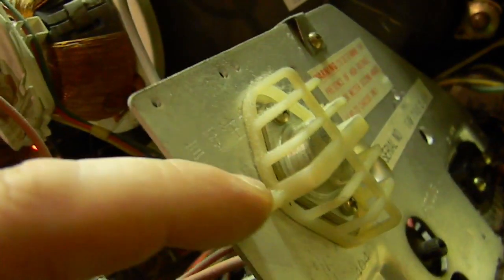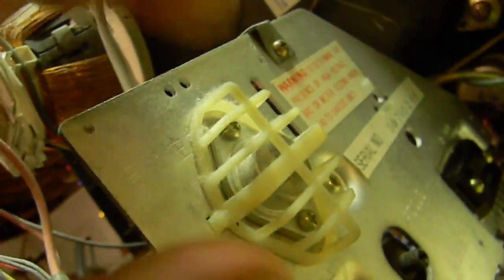Look at the TV tuner. Oh, I thought it was attached to the board down here. So the tuner is just on upside down. Upside down digital tuner. And the pretty small little flyback. It's one of those style. And a horizontal output transistor has got a little plastic cage around it. There's a rectifier for something. There's our little speaker, and there's our front tuning board. And this thing actually puts out a really good picture for the amount of dust on it. Everything's nice and labeled out in the, what do they call that, silk screen or something, when it has the print on it.